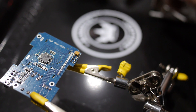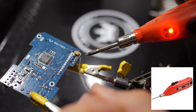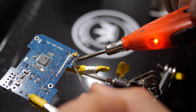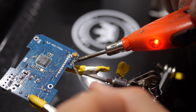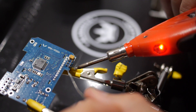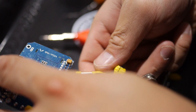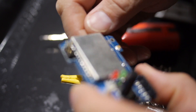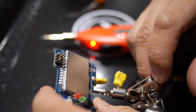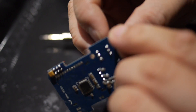Next I'm going to show you how to solder the header pins to the 4-in-1 module. I'm using a very low wattage battery powered soldering iron, so you don't need something too hot — just enough to melt the solder. It takes a lot of practice to be able to solder. The only experience I had was back in high school electronics class, and even then I wasn't the greatest. Over time I just practiced and got better. I recommend you get an old junk PCB board and practice soldering — it's a skill you need as an RC enthusiast.